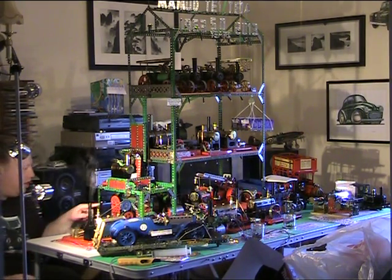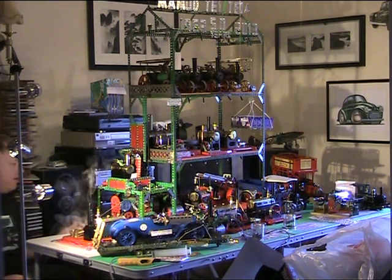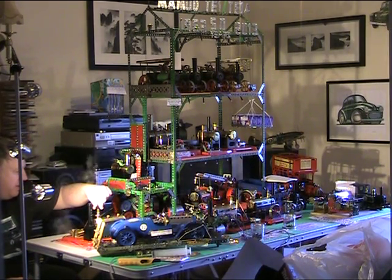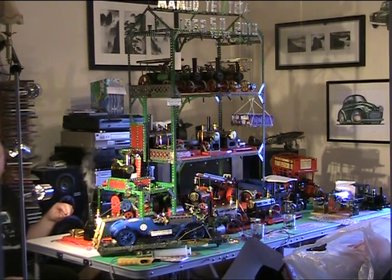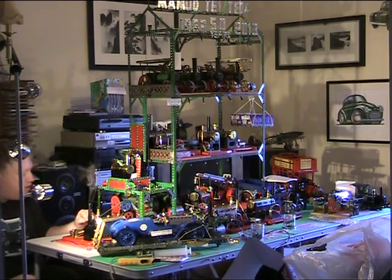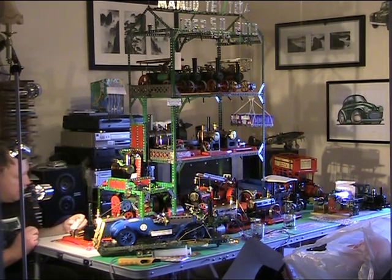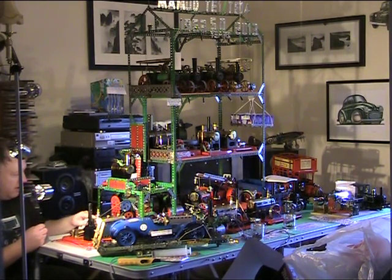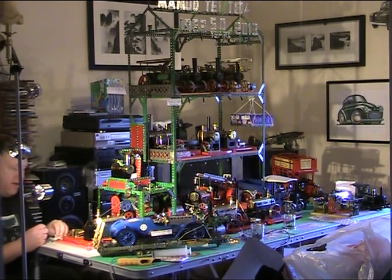Ideally I would have liked a larger pulley this end to give more pull than speed, but as it's such a low gear we've got away with that. The SP7 is only fitted with the one pulley, which is the one machined into the flywheel, because you've got the two slip eccentrics on both sides for each piston — there's no room for an ordinary pulley. I wouldn't say that's a drawback as such; it just takes a little bit more thinking about when you're going to drive something.